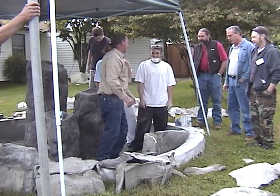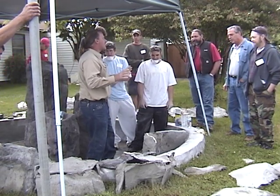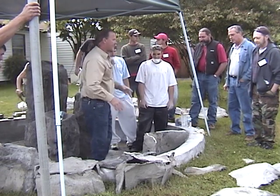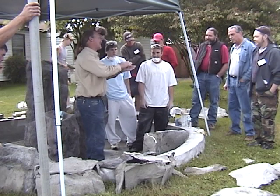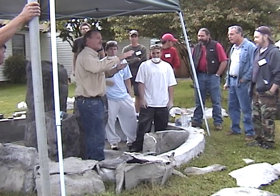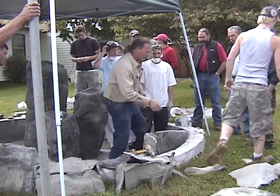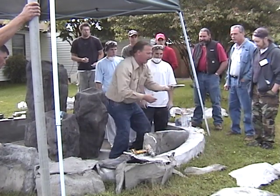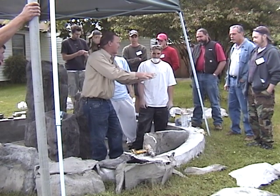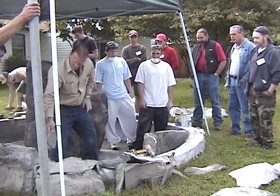It's not even necessary. A lot of times once we get this mud, we'll just come back and chop off anything that looks odd — sometimes that's easier. You're not trying to make a puzzle here. In fact, the muds we're going to use today can span six inches. There's no mud you'd ever touch by hand that will free-span six inches horizontally. It's about three-quarters of an inch, but you could take this and put it right in that mud and use it as a backer, or you can just span it.